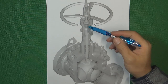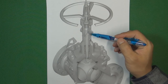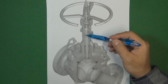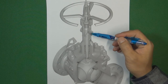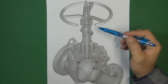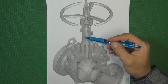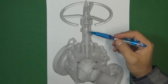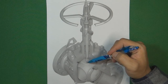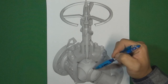When we turn the wheel located on top of the orbit ball valve, the valve stem moves up first, because the valve stem is controlled by the orbit slot and the pin. When the valve stem travels to a certain position, the pin controls the valve stem to turn to 90 degrees. So the orbit ball valve stem movement can be divided into two parts: one is moving up and down, which is the linear travel, and then the stem turns, which is the angle travel. This controls the ball to leave the valve seat and then turn, and also when closing, the ball turns and then touches the valve seat.